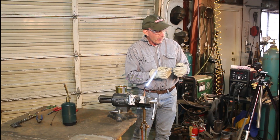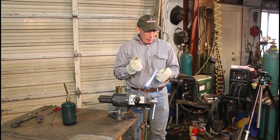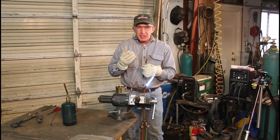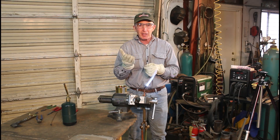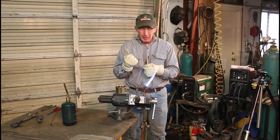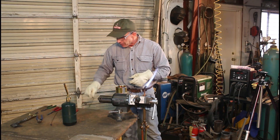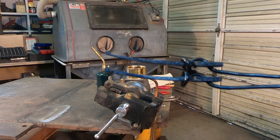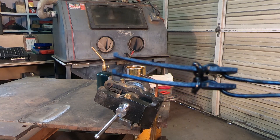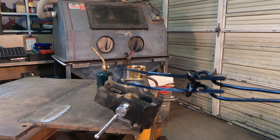There's one down. That spring is now extremely hard but also extremely brittle — that's where the tempering process comes in. We'll have to draw it back to a consistency that is still hard but has some flex in it. At this point, if we put this in the gun and worked that spring it would just snap — it's about like glass. I'll go ahead and do the other one quickly and then we'll get to the tempering process. Now we've got two hardened springs with virtually identical profiles even though they started out with completely different profiles. We're going to clean up all that old burnt oil off of them and take them over to the casting pot to temper them up.